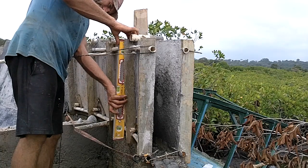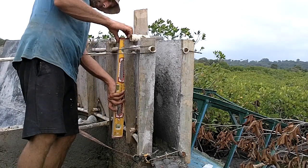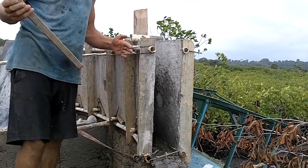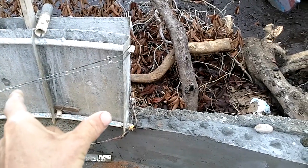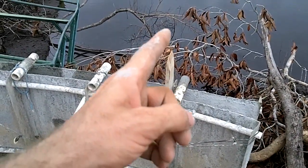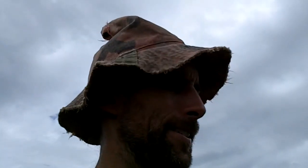I am actually measuring my angle now — over about a 50 centimeter difference between these two pipes, I'm coming in about 5 centimeters on this level, and then the next level maybe 6. I want it to keep slowly sloping in a little bit more each time. This thing goes right up to where I do not want to have a seam — I don't want a seam where these two walls meet. I want this piece to go straight across and the next piece over there to go straight across above it. So I'm putting my stick here; this wall is going to end here, and the next one will go from there right across the connection to over here. That'll make it a little bit stronger and I want to give it the best chance of working.